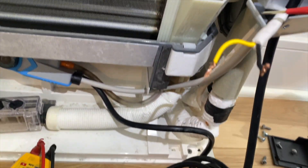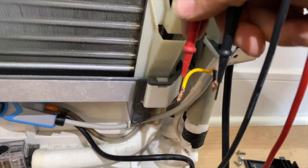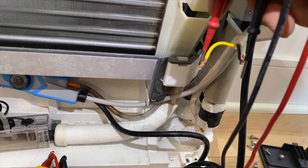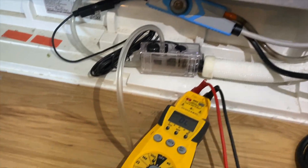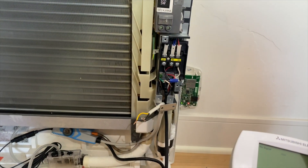This is the drain switch - high voltage goes in, comes back, and then goes into S1. I should be getting continuity right now, which I'm not. So that confirms the issue.